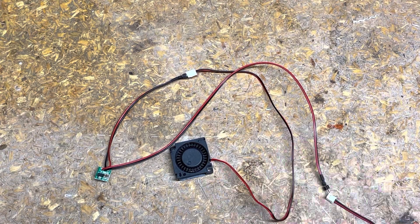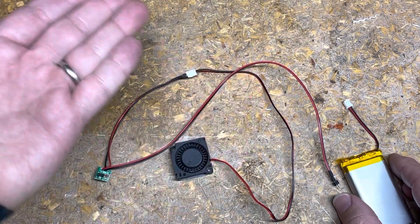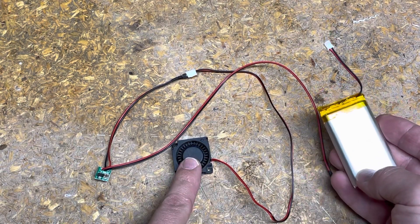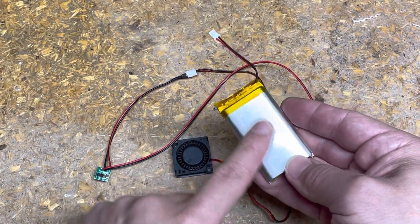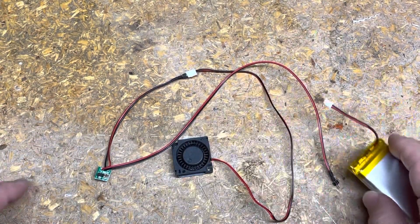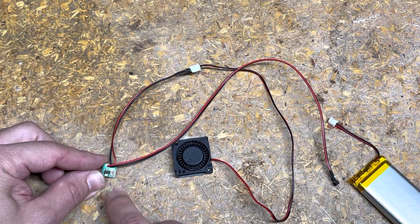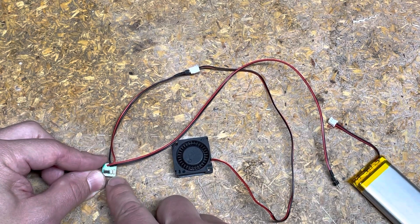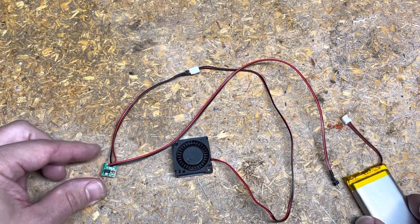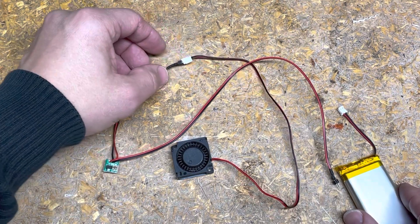Can you connect the 3.7V battery directly to the fan? Yes, you can. But what I found is that because it's not the right voltage — this is 3.7V and the fan is a 5-volt fan — it will suck more energy from the battery quicker. So in order to balance that out, I'm doing a step-up conversion to 5 volts using this little board. For a buck sixty, it's a no-brainer so I don't burn through my batteries quickly.